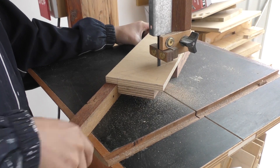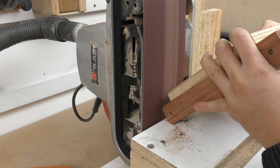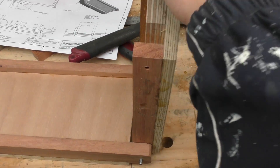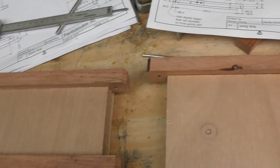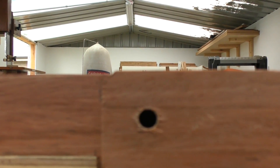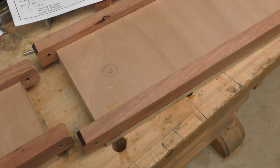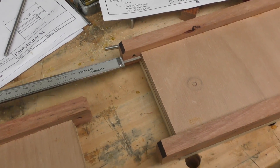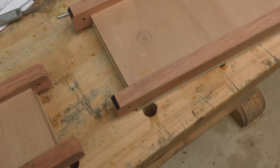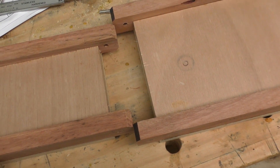After the glue has dried overnight I can cut off some of the corners. I've been playing with this a little bit and tried assembling it — the operator link fits in just fine, but the short link and the long link don't fit together at all; the holes don't line up, as you can see there's quite a bit of difference. After checking my drawings and measuring, I found that this bit is actually 25mm from the edge but it's supposed to be 30mm. To fix that I'm going to carve a channel out around here with my table saw and hopefully it will fit together.